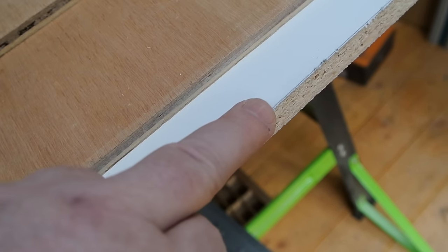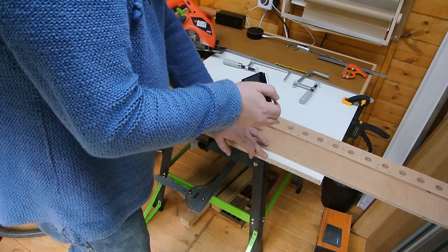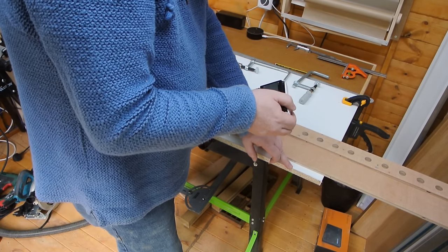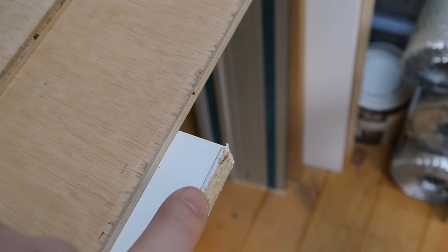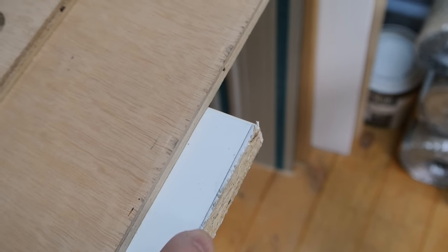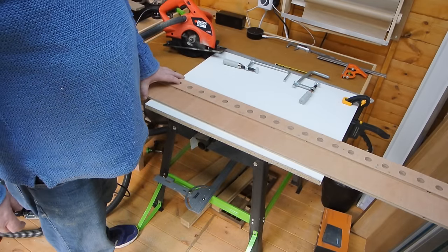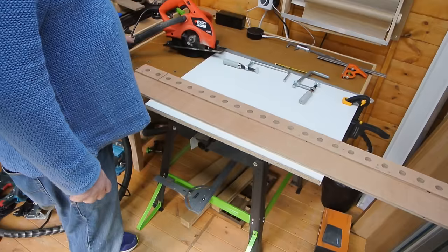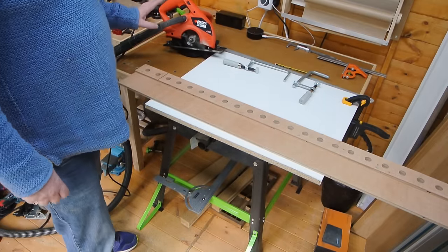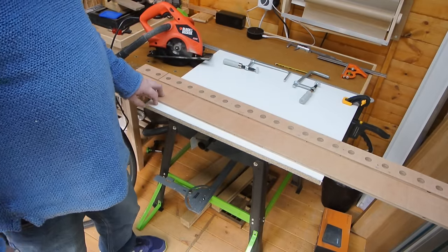You can see that the cut is not as sharp, though it's still very good on the back side — this is always where you tend to get tear out, so it provides a little bit of support to the cut. I've done it on this particular cut but it does happen quite a lot. It's one of the faults of a DIY rail in the sense that it doesn't lock the saw to the rail — the saw can wander into the waste side of the cut and leave you with this drifting of the line. Dust collection-wise, the Black & Decker saw doesn't really collect as much dust as the Makita — there is a thin film of dust absolutely everywhere. So I'm going to complete the build with the Makita guide.